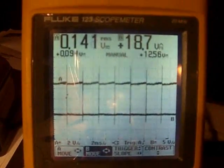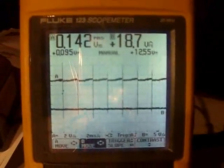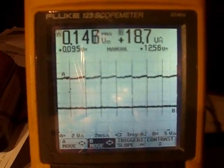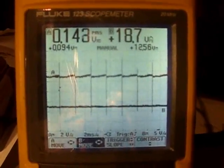While lighting the light, you can see that the peak voltage is getting pushed to 18.7 volts on that battery, which is a pretty good voltage to get kicked to. The average voltage on that battery is 12.56 right now.